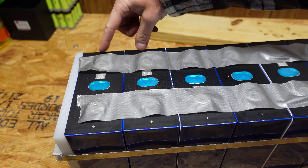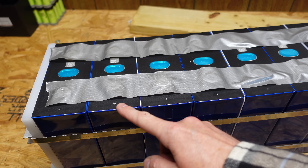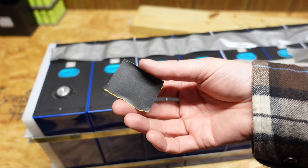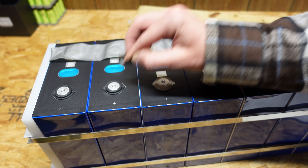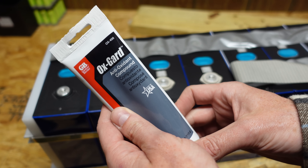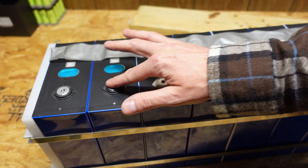For making the connections, I have two negatives in the back — this will be my main negative for the battery pack. So I have a positive here and two negatives to join, which puts these two cells in parallel and then series them with these two cells also in parallel. I'm taking a small piece of 800-grit sandpaper and lightly going over the terminals to remove any oxidation — not scraping hard, just removing the oxidative layer. Next, I'm taking a little bit of Oxgard antioxidant, which is for aluminum-to-aluminum or aluminum-to-copper, just to prevent an oxidative layer from forming over these terminals — a very light coat.